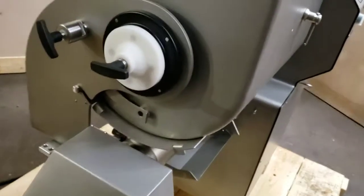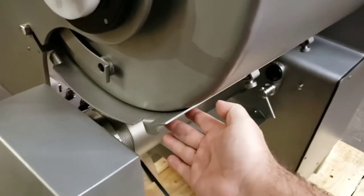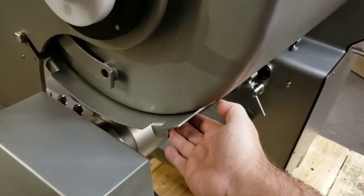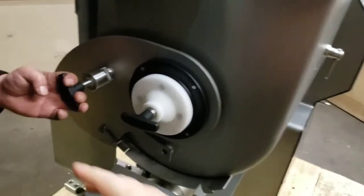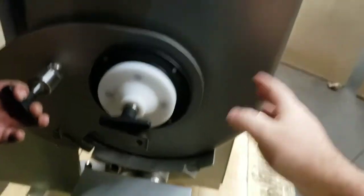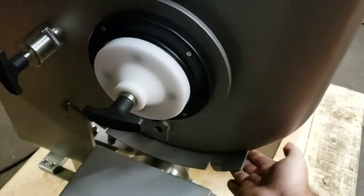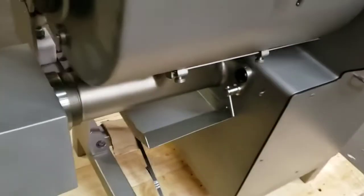One thing to note is when the slider gate is left on grinding mode, the user is not able to move the hopper to offloading position. Even if you try here on unlocking it, it will not move, because the sliding plate for grinding is protecting as a safety so that it doesn't move. Only when it's closed can the user offload the product.